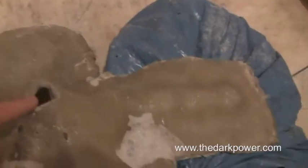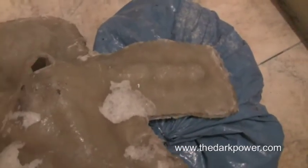So here's just a few shots of the back of the mould — basically the silicone is going to be poured in through here. I've basically cut these at the highest point of the mould when it's laying at its front, so that when the silicone is poured in it will just pour through the whole mould.